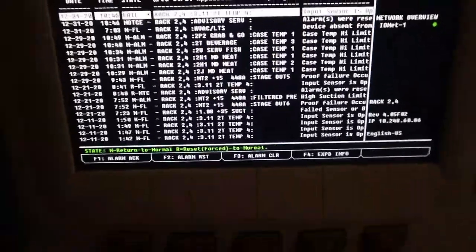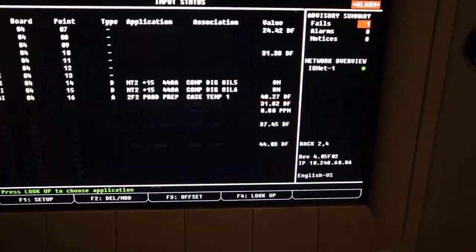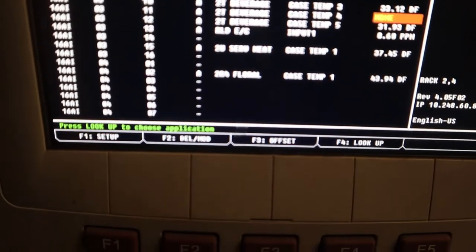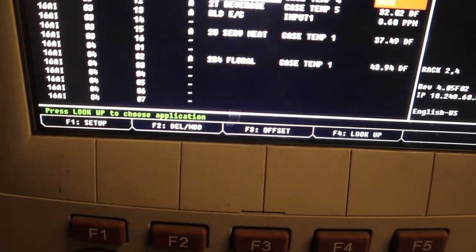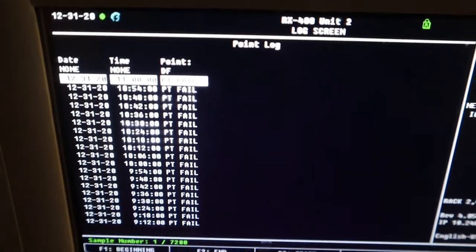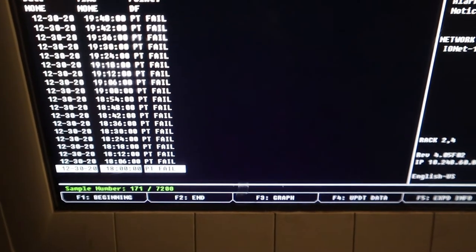What is going on everybody. In today's call, they called in that the E2 was alarming. It looks to be an open sensor — there it is for the beer case, case number four, system 2T sensor just wide open. And as you can see looking at the graph, it hasn't been reading for a while.